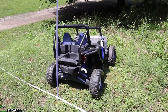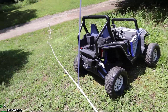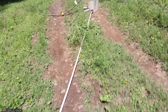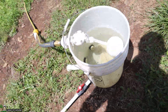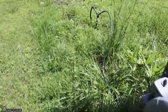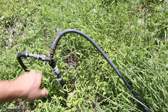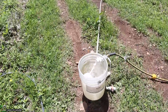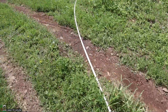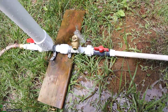Or even build a little 2x4 frame to hold this up, because when the pump starts cycling it can shake this around. I find that a children's electric Jeep is the best way to hold up a stand pipe — just kidding. Alright, let's go ahead and turn on our water here. This will fill up the drive pipe. I have the delivery pipe primed. I'm going to go ahead and turn the pump on so you can see what it looks like when it cycles.